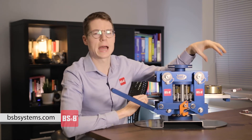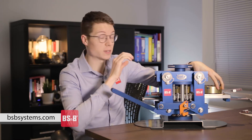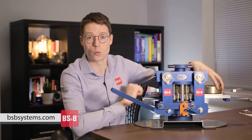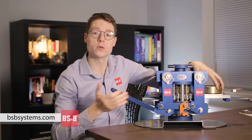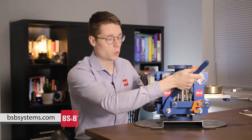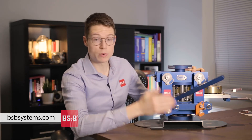At this point the activated disk is out of service and can be replaced at your own convenience, and in the meantime the standby disk is now in position ready to go into service. We just need to reseal the system by moving the lever arm back across. You know it's in position because you get a nice audible click. Now we can re-lock the system, re-pressurise the line and restart the process.